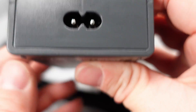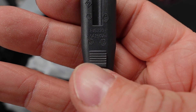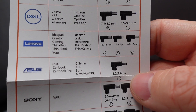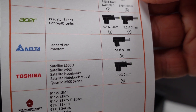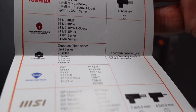The experience of unboxing the F-240 is almost exactly the same — the box is really the same. The same accessories are included, except now the AC cable is required as it connects to the power adapter, and it uses an IEC 320-C7, aka the figure-8 connector. One nice thing that comes in the box is a detailed laptop adapter plug connector card, which is actually pretty useful to find out which adapter you may need. But be wary — some laptops may need the power adapter to have a chip in it to identify itself, such as Dell and HP. These may have issues with these power bricks even with the correct adapter.